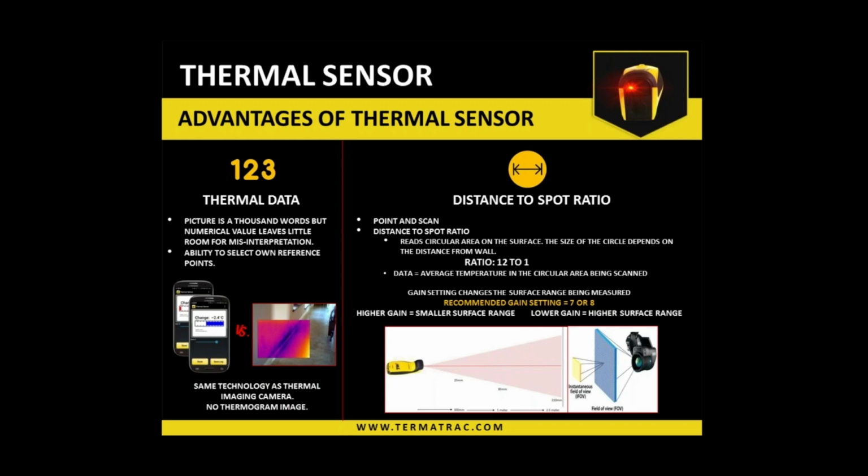Why not first time I will use radar only? Okay. So the short answer to that is the moisture sensor or the thermal sensor is pointing you to an area which may not be visible to you as far as activity is concerned. So you wouldn't go through the whole building with radar only. It would take too long to do. Correct. So you do your standard inspection techniques first, which hopefully point you to certain areas, or the moisture or the thermal can help point you to an area of concern by picking up those anomalies, if there are any. So then when you get that anomaly, you've got an area to focus on with the radar.